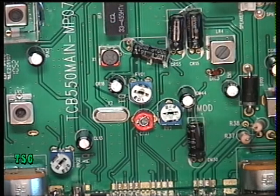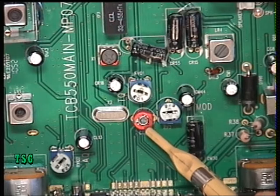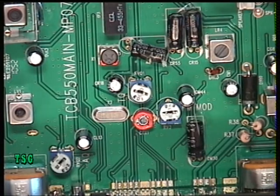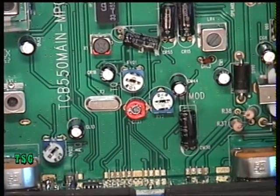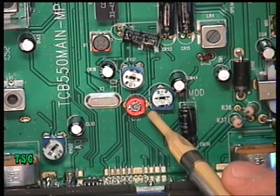The next thing to do — step one on setting the transmitter up — is to make sure it's on frequency. The 10.24 MHz reference crystal is there, and the trimmer capacitor for the frequency is there, labelled CTX1. Going into transmit, we're using channel 20 on the UK band, which is 27.79125 MHz. We're only interested in the UK band, not the EU band — otherwise we'd be setting it on either channel 1 of the UK band or channel 40 of the EU band, so we want it in the middle. I've got 27.79120, so I don't need to touch that, but it is that trimmer capacitor.